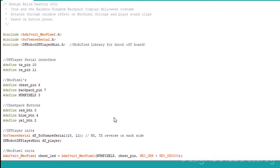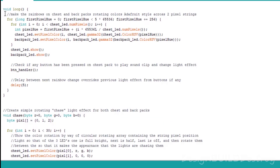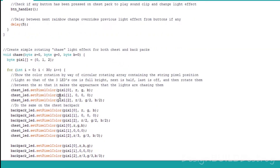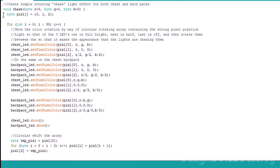The code is pretty straightforward. There are two strings of NeoPixels that rotate through a rainbow color-changing sequence forever, and built into that loop it checks to see if any of the three buttons are pressed — no need for interrupts, just keeping it simple. When it recognizes a button is pressed, it flips over to playing a sound clip and changes the NeoPixel strings to a rotating chase effect using the color of the button that was pressed.